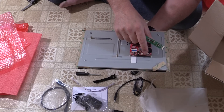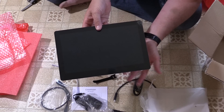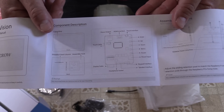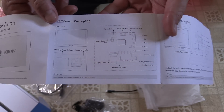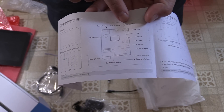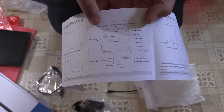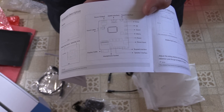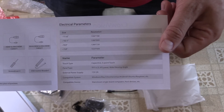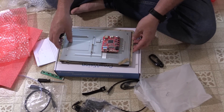This is the little keypad that goes with the keypad connector, and we have a ribbon cable for that. This is the front of our touchscreen — doesn't look like much now, but let's hook it up to a Raspberry Pi and see what it does. Reading the little manual, which is actually very good, I realize I may have misspoken about a few of those inputs and outputs. The larger USB port on the back is power output, the smaller one is the touch interface, and the barrel connector is the power input — so this can provide power to your Raspberry Pi through the control board. The manual gives you a connection diagram, and we're using the 11.6-inch model here.